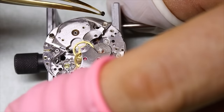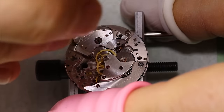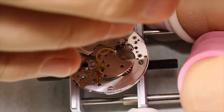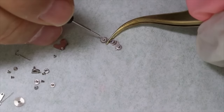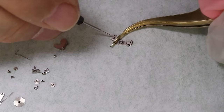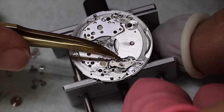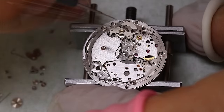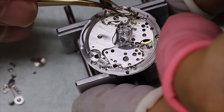We put the setting lever spring back in under the barrel, the barrel back in, screw the barrel bridge down. We will put a tiny drop of HP 1300 or similar on the dual bearing for that barrel. And then we will start looking at the keyless works. The coolest thing about the keyless works in the 341 is of course the rocker — the wheels are riveted to the rocker, so we put a little bit of oil there to make sure they run freely. We secure the rocker with one screw, and the screw hole is actually in a tube that is press-fit into the main plate. The tube also has a horizontal hole drilled through it for the stem to go into.